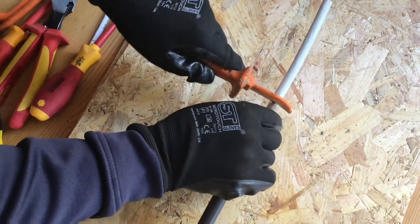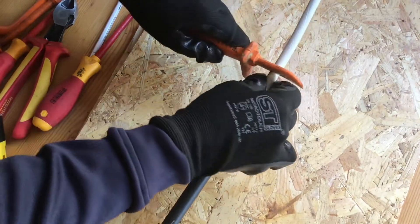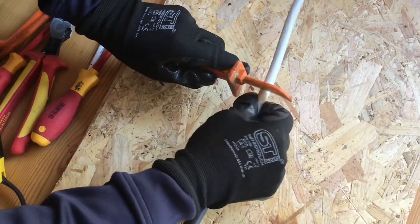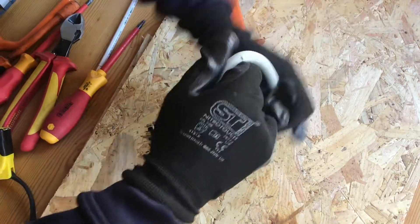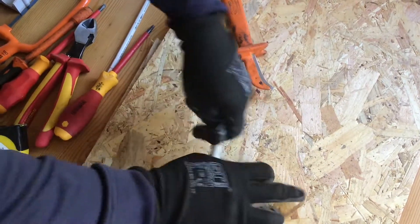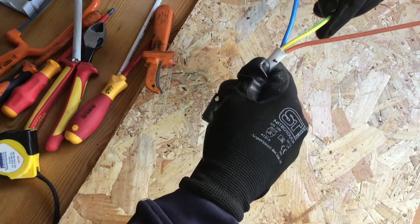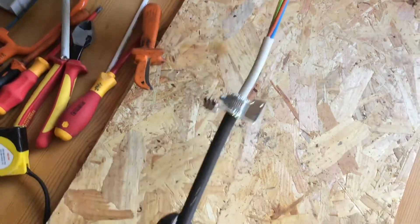So I'm not actually cutting into this — I'm just very gently working around it, moving the cable as I go, carefully bending it. I'll gently score around it again and bend it back. Now I can see some conductors coming through. I'm now going to check that I haven't scored any of the conductors — my neutral is good, my CPC is good, and my line conductor is good. I can now mount this to the backboard.